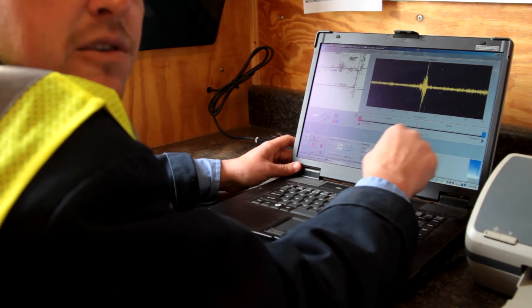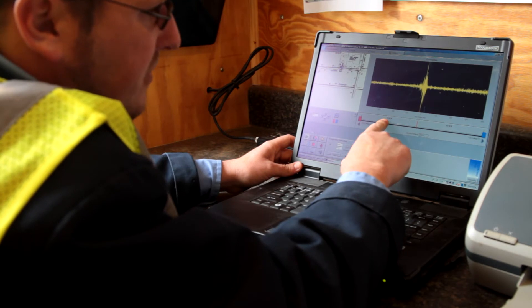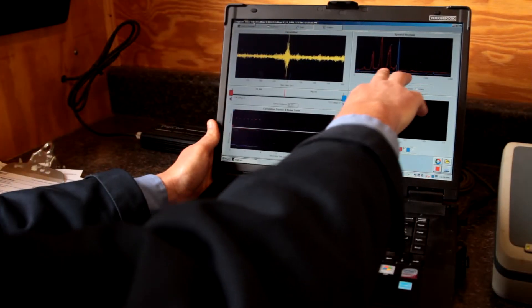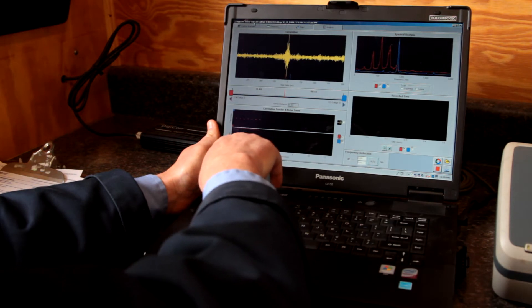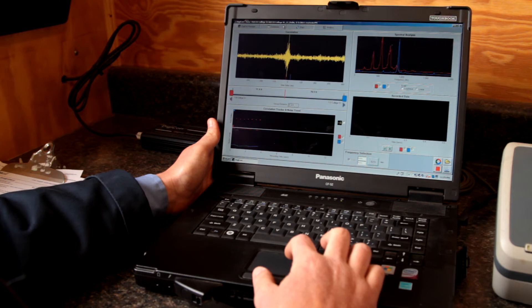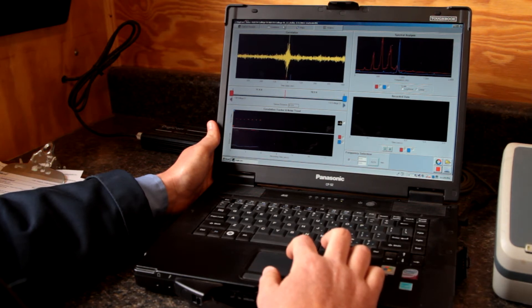You go out from that red unit, wheel off the distance it's telling you from the red one, and go ahead and sink a bucket. This is your analysis and this is your noise tracker — they're both really high. I mean, you've heard it yourself how loud it is; it sounds like gas. Is that really what they sound like? That's exactly what a water leak sounds like — it's interesting because it's under pressure.